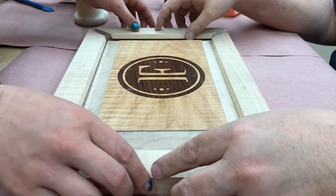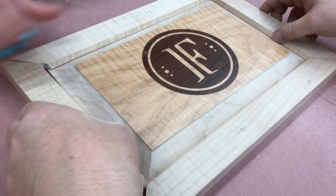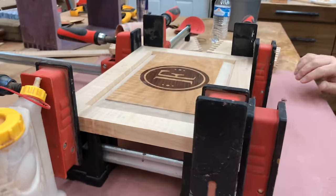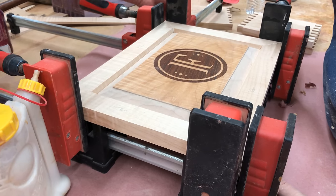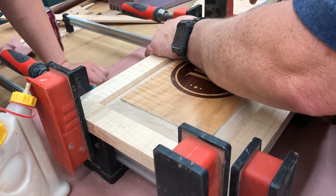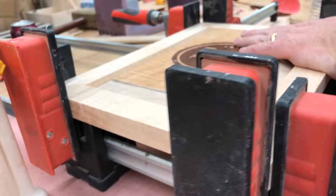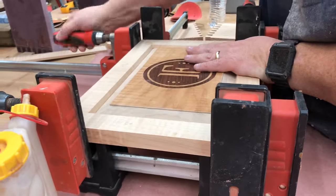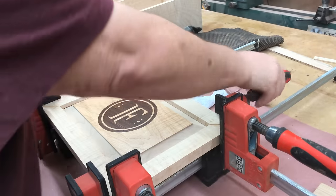That's actually one of the things that makes an end grain glue up so weak — the glue gets absorbed up into the end grain before it has a chance to cure, and there's simply less glue in the joint. You might notice that I had the clamps completely set up and pre-adjusted to make this clamp go as easy as possible. When gluing together mitered corners like this, you have to take your time and tighten and loosen back and forth, kind of jockeying with it until you get the miter joint glued exactly right. We're going to let that glue up overnight, and I'm going to cut the video in half right about here. I hope you come back and see the second half of the video. Thanks for watching.